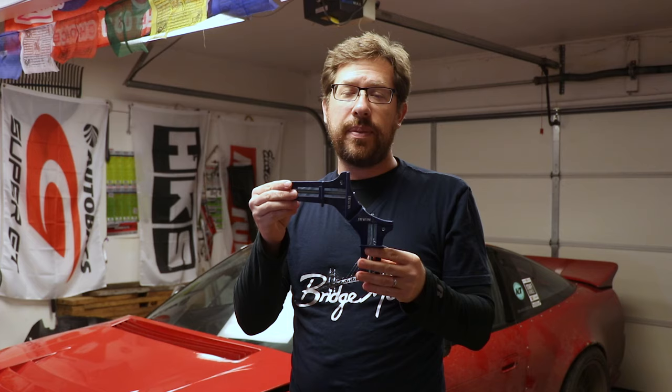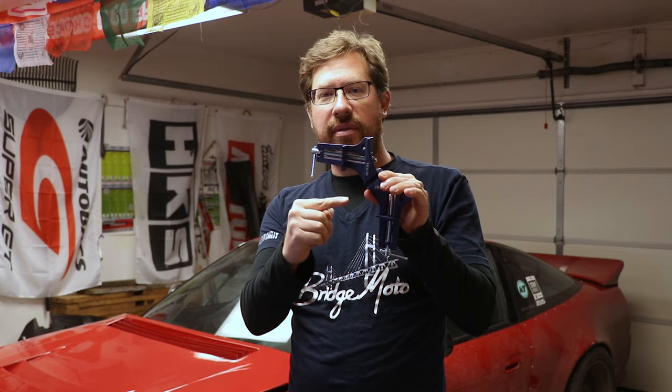Last for tools, you'll need clamps. Your classic C-clamp is a main workhorse, but I also found 90-degree joining clamps very helpful — they hold two pieces of board at a right angle while you drive screws, which really helps get the job done accurately. That plus patience, time, and spray paint or brush paint of your choice is basically all you need. Next we'll head to the whiteboard to get into the actual build.